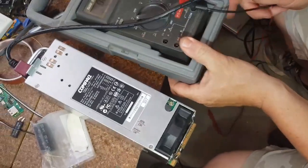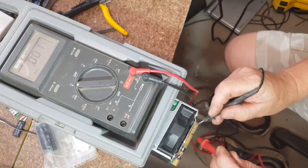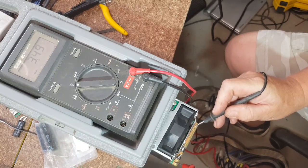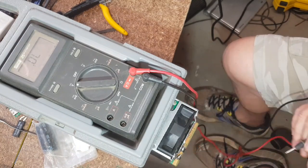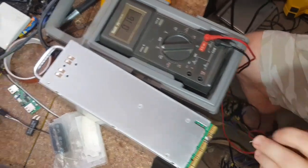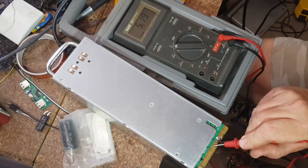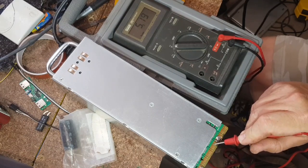I'm just trying to get a good spot for you guys to see what I'm actually doing. So we've got the multimeter across the 12 volt line — there's your 12.6 volts across there. I don't think that's a negative line so I'm just checking the others — nothing there. There's a three volt line over towards the left hand side, and that's your earth. Now I'll flip it over. Just remember it's got 25 amps coming off this baby. There's your negative line there, there's 12 volts again, but nothing there. There's your five volt line there — I'm not sure whether that's the ancillary or the other voltage.